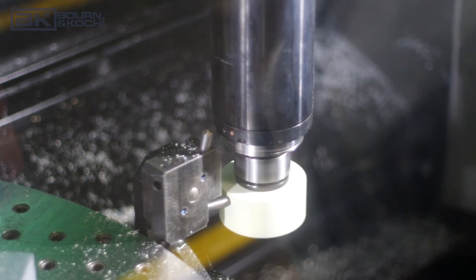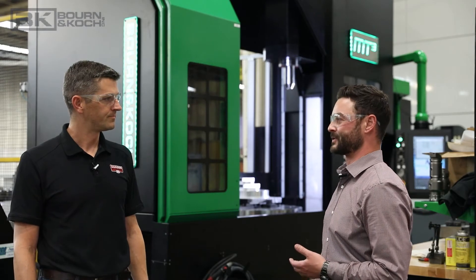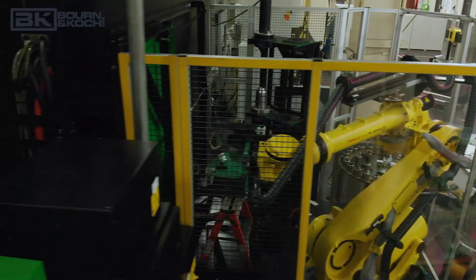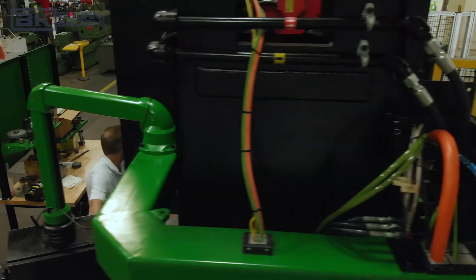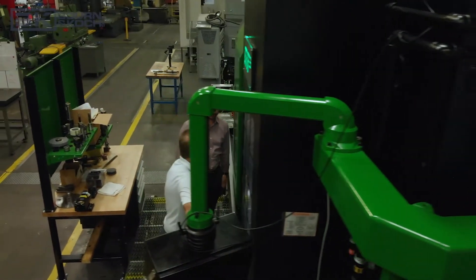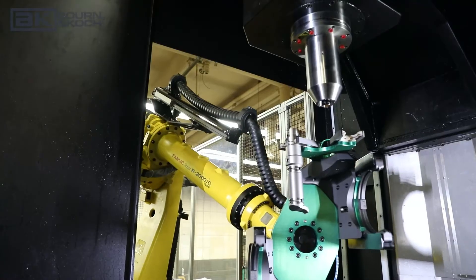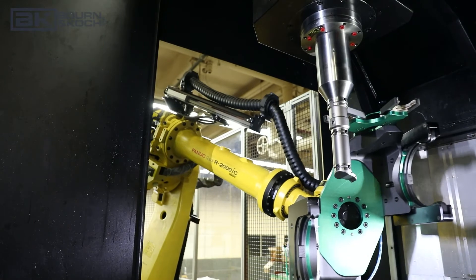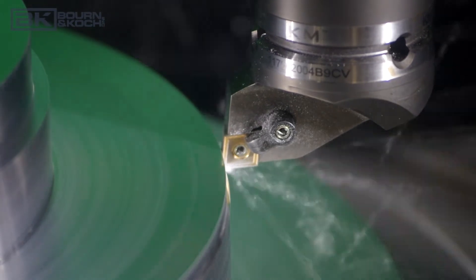That's crazy — it's really cool. It allows you to put a part in and take a part out finished. Before, if you wanted to manufacture that circle diamond square test but also hold a couple of tenths on that outside diameter, you'd have to take it from machine to machine to machine, reset it up, refixture it, and you may not get what you're looking for because every different setup introduces error. This allows you to go in there, mill it, turn it, grind it, pull it off — one and done. The turning tools are dedicated static turning tools, so we don't lock the spindle — there isn't any of that issue you can see with that type of setup for doing a mill turn.